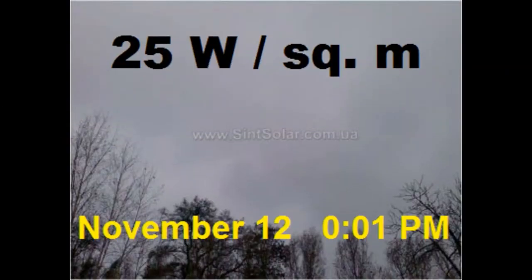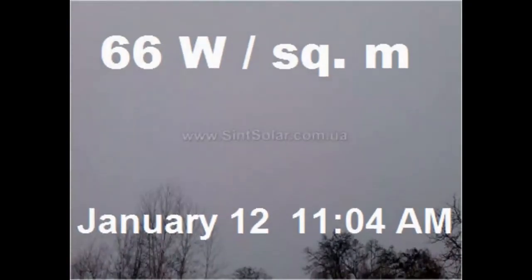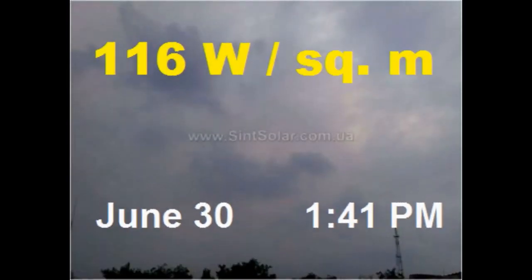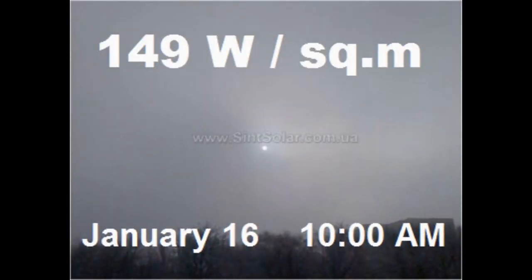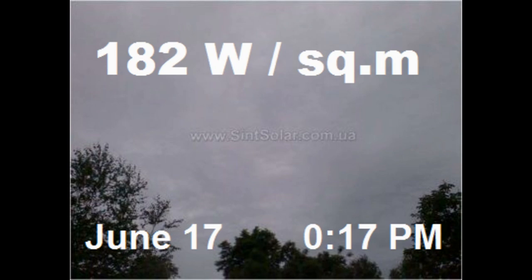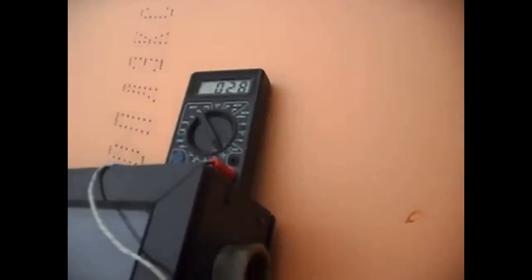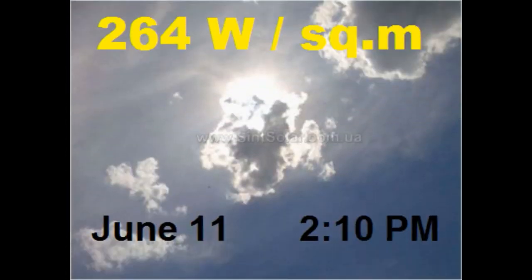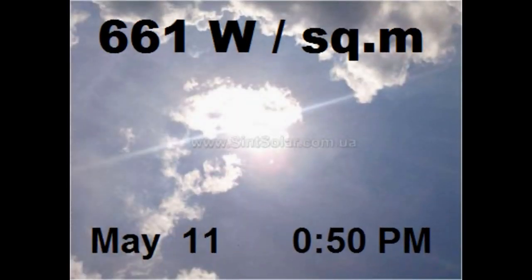But on the other hand, sometimes our collectors can produce heat during cloudy hours, and I remind you that our calculations did not take into account this possibility. Now I show examples of solar energy flux from overcast sky of center Ukraine. Of course, the capacity of our solar collector in the case of an overcast sky will be several dozen times less than in the case of an uncovered sun, and the temperature of our useful heat will be very low. For example, this collector heated the water inside its pipes to a temperature of 28 degrees Celsius when the sky was so cloudy and the ambient temperature was 4 degrees Celsius above zero. In addition, our calculations did not take into account such cases when a cloud temporarily covers the sun, and we see that the solar radiation flux from a similar sky is several times greater than for the case of completely overcast sky.